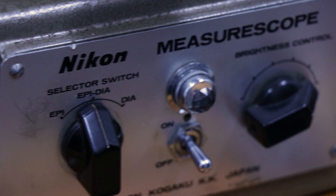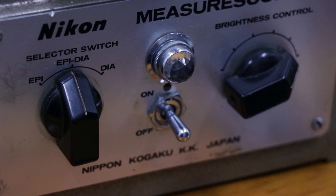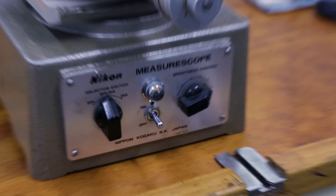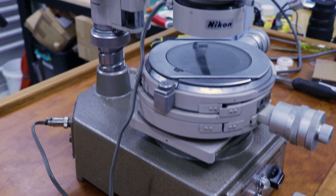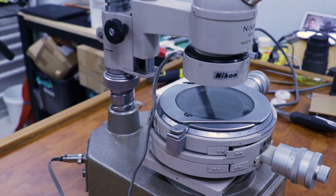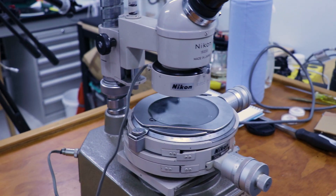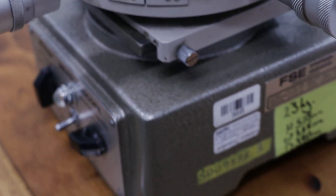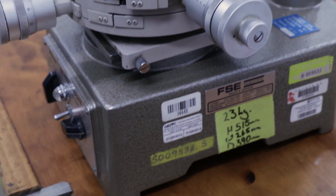This I picked up on eBay. It's a Nikon measure scope — a toolmaker's microscope with an XY and a 360 slide on it. It's got micrometer adjustments. The only issue is that it only has about 25.4 mm travel in either direction. It is metric, but it's still one inch travel. This definitely helped me measure distances between drill holes and try to set up an XY coordinate system for the holes that I'm drilling.